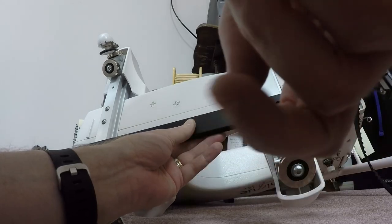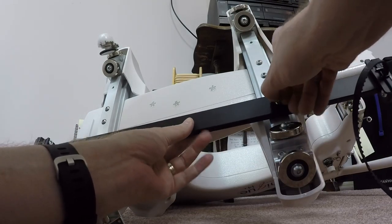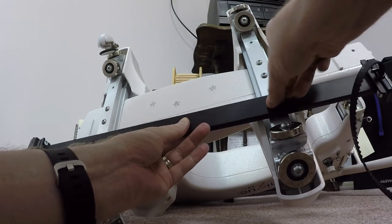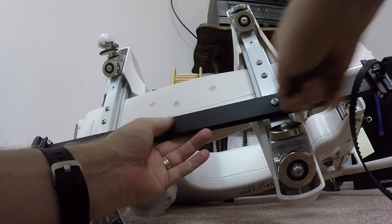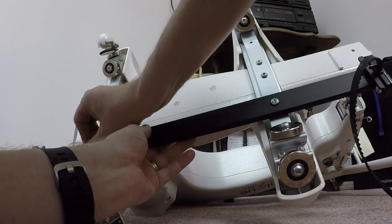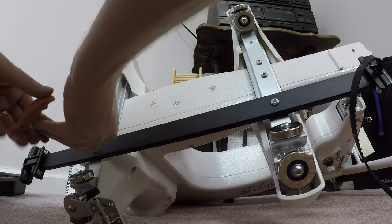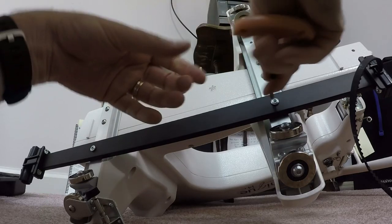these 6 millimeter bolts, whatever they were that I used earlier. I'm gonna feed them through, mount it to the frame, attach it with the Allen wrench. Again, nothing's gonna be tight, so I'm just gonna screw that in place. There's the one end, there's the other end, and again, everything's on the right side of the machine, so this is installed to the right side. And I'll take my Allen wrench and just loosely tighten for now. I'm not going to make it too snug yet.